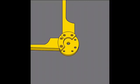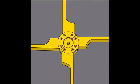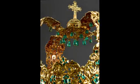And trying to fish 8 tiny number 2 screws in through the underside of the crown amongst all the hanging emeralds seemed like an impossibly fiddly task. Also, the way the crown would be displayed, viewers would be looking up into the crown to see the dangling emeralds, so having 8 visible screw heads would not be ideal. Instead, I developed a disc system.